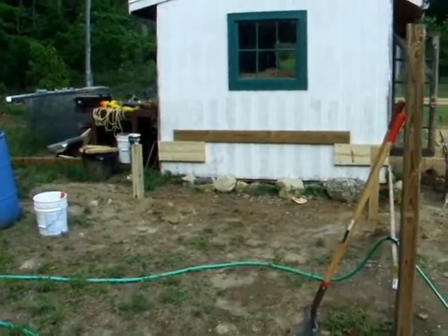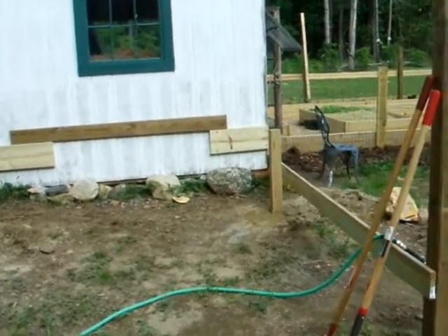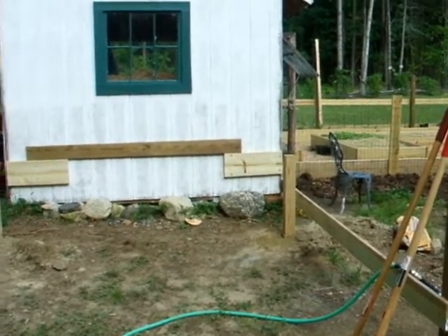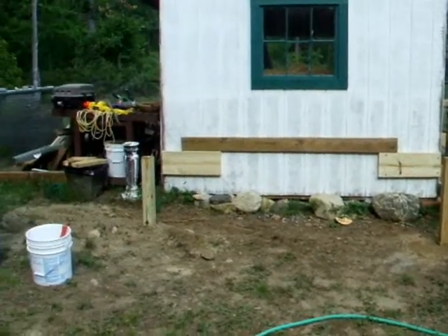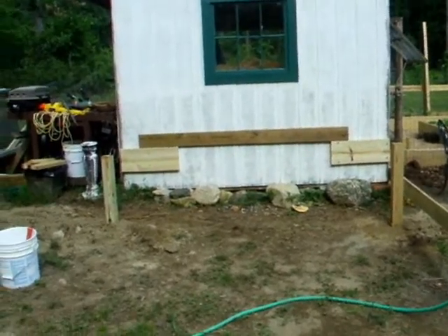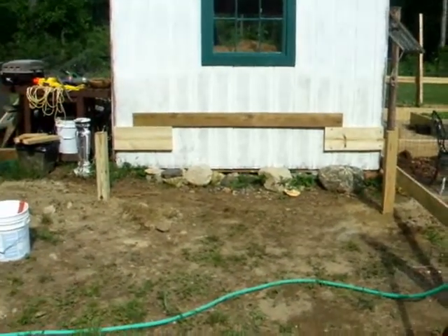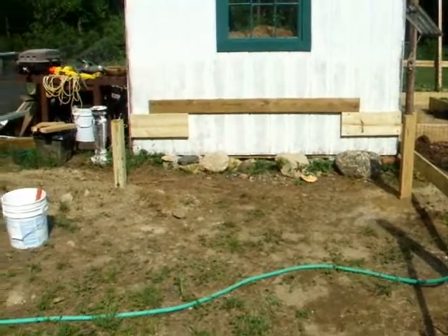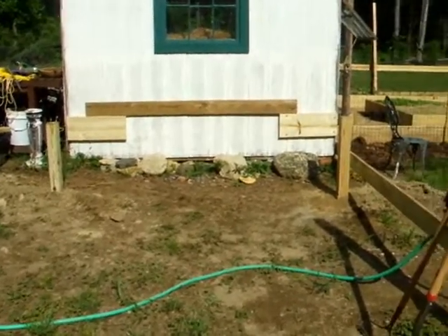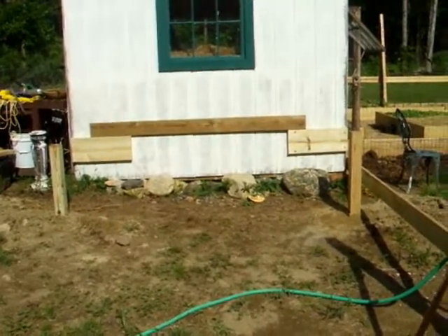The posts are in, they're secured. They're not cut to the right height — I wait until I get everything level; it makes it easier. The 2x10s you see in the back against the shed are getting lagged in. The board up there is just my board I use for a long level — my eyeballs aren't as good as they used to be, especially when the ground's not level, so I actually use a level. I don't really want the barrels rolling, although they will be braced. Side pieces are coming over and long pieces are going across, and you'll see it in a bit.